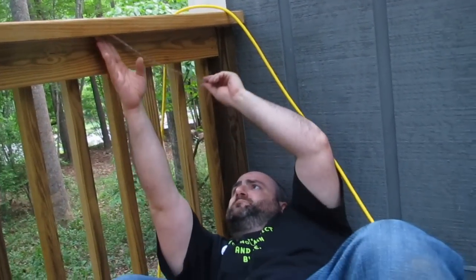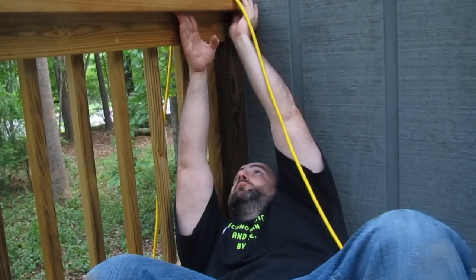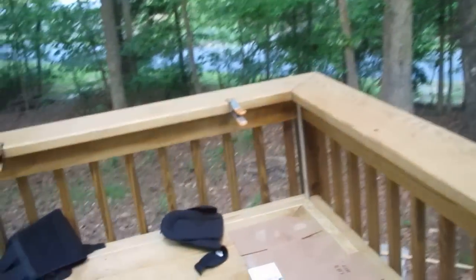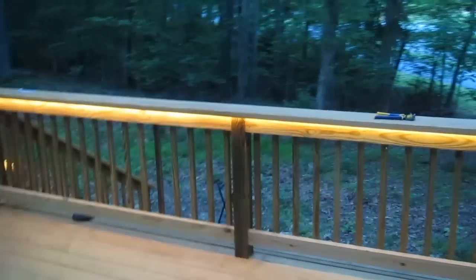Here's Spitz sticking down the very last little bit of the first strip. We're putting that into the aluminum extrusion that's been fitted into the dado of the handrail. It's got some nice 3M tape on it and our lens is going to go over all of that — but first we want to get them all stuck down. I think it looks pretty good. I think it's really neat because you can't tell where the heck the light's coming from and it's very even. I think you made the right choice going with 300 per reel — 300 per 5 meter — that worked out much better.